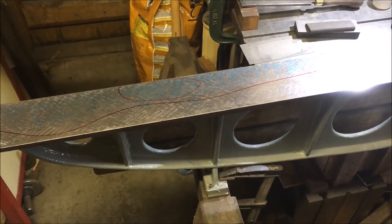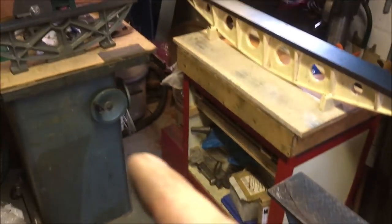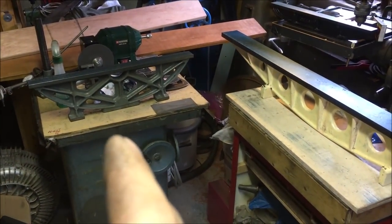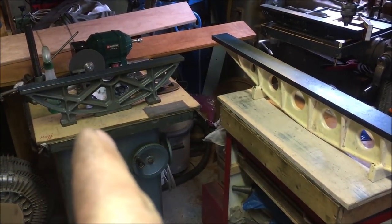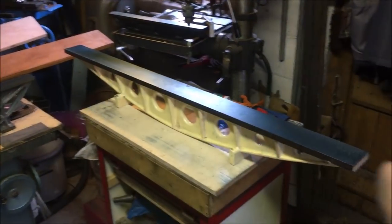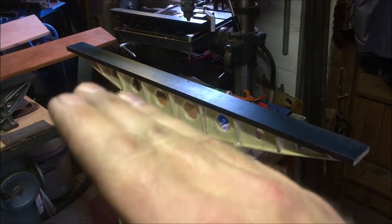This clip's not been rehearsed, so you'll have to forgive the blethering, but I've just gone back through and rechecked everything to make sure nothing's shifted. So that is my 24 inch straight edge, which I print straight off the stone, and that's my, let's call it, my precision one. I've got most confidence in that one. If I do three prints on that, I'm getting perfect coverage. Index it across and print it three times that way, perfect coverage.